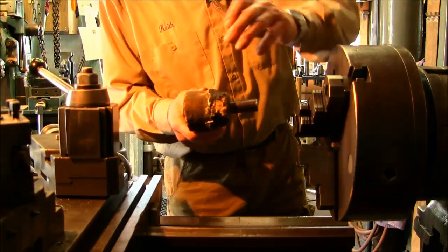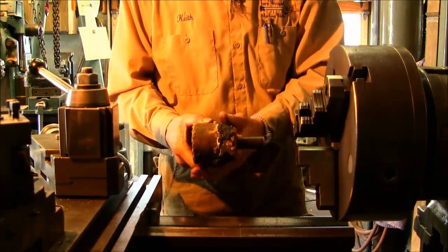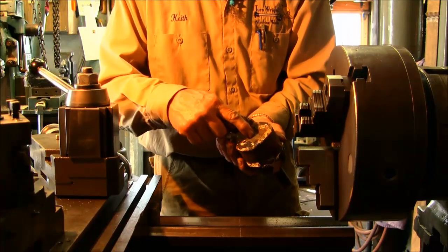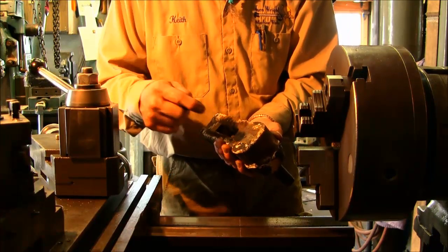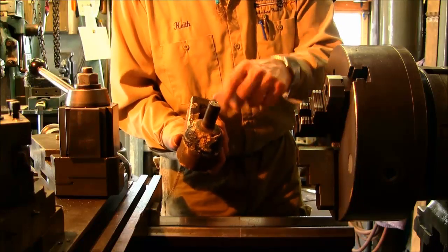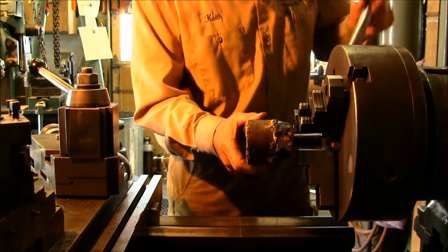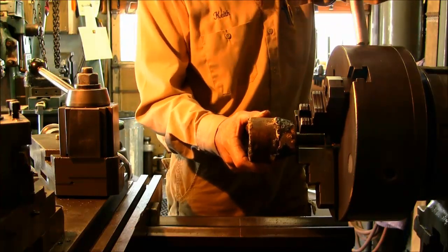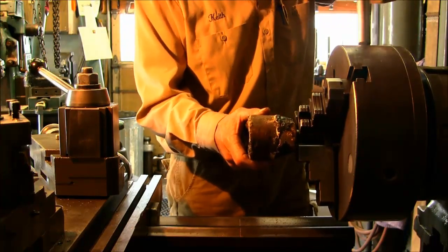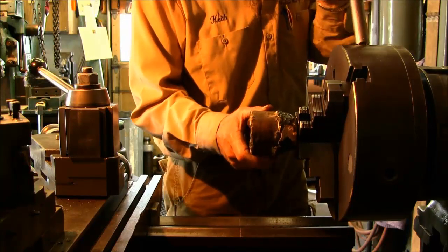And now we're trying to grab a hold of this pin so that we can create a center drill hole over here, straight in line with that axis of the shaft. That's why we dialed this one in to get this one here, but we're going to go ahead and support this by the 3-jaw chuck here. And this is all within the tolerances that we feel are acceptable.